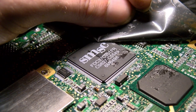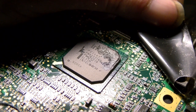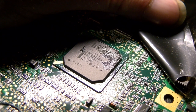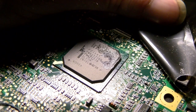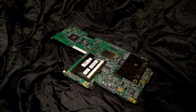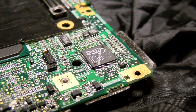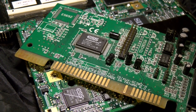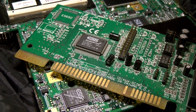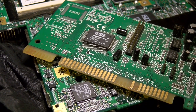Next to the video chip is a floppy controller, then a PIIX4 Southbridge - PCI-IDE ISA Accelerator - the same chip used on desktop motherboards for late Socket 7 and Slot 1 boards. Then we have the ESS ES1869, in a smaller package than you'd see on a desktop motherboard or ISA sound card, but it seems to function the same and uses the same drivers.